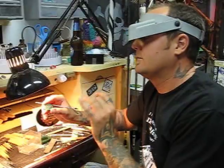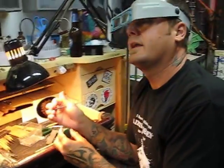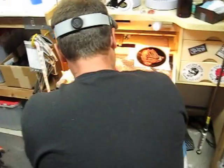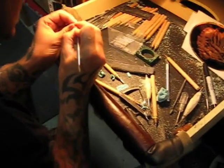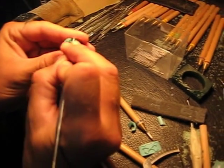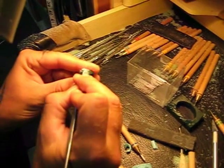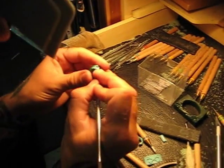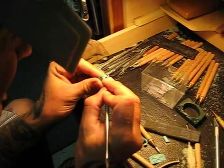I'll clean some of them up in silver, but that's what I was worried about — not so much what I'm putting on now because they're clasp mechanisms. In finishing, it's better done in silver. Just spend a few moments here with my tools. Smooth it all out. Mixing these two waxes together is real fun because one wants to act like a carving, and the other one just wants to get gouged because the softer wax does not like these tools. Fun little challenge, which is again why I'm not super worried about getting this thing perfect. That'll happen in silver after I send this piece to the caster.